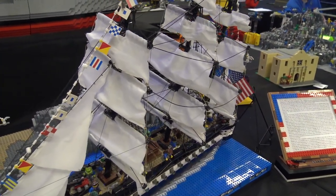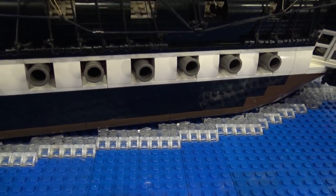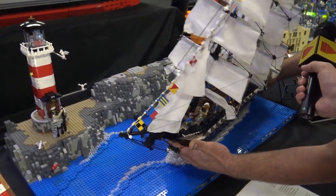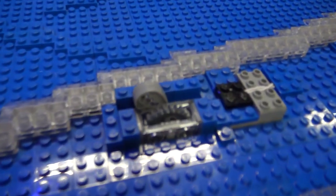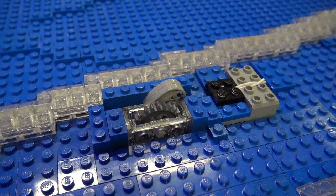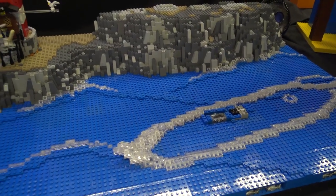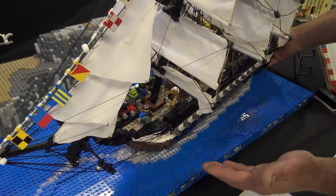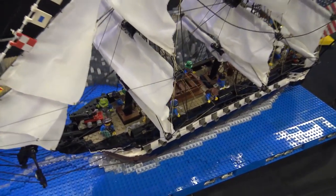The boat mechanism to make it rock was pretty simple. I'll pull it up here in just a minute. I've just got a simple little camshaft lobes hooked to a worm gear box and a little motor, so nothing too fancy. Tiles and stuff create a cradle for the boat so it doesn't push it too far away. Even though it's not crazy complicated, it creates a great kind of rocking motion that gives a nice extra level of detail.